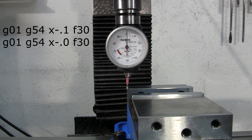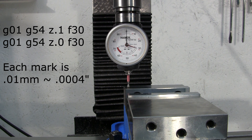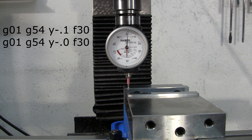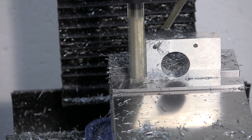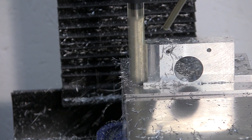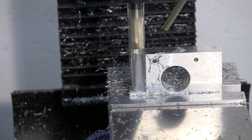I have roughly one thousandth of backlash, but with Linux CNC compensation, backlash is practically non-existent. This amount of backlash is better than my skill level. Also, when taking large cuts, the column head assembly seems to flex more than this, and as one learns their machine, workarounds are found for machine-related errors.